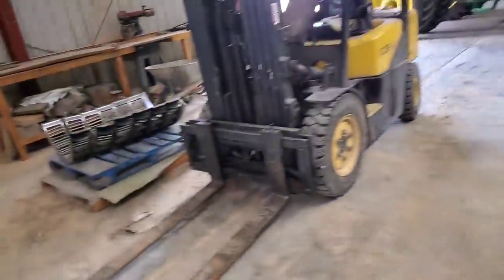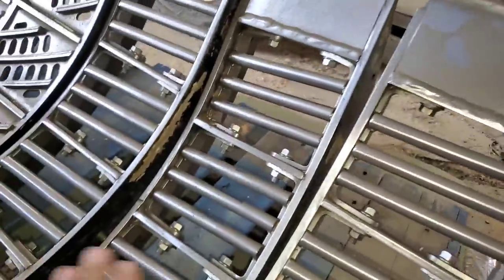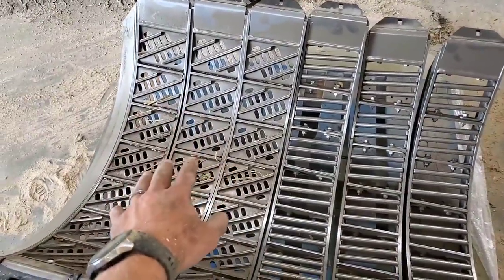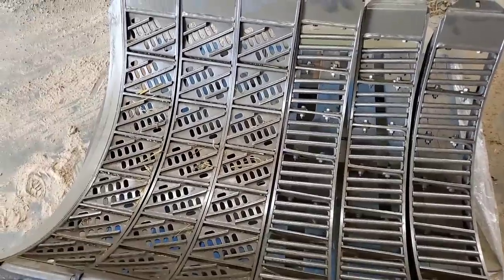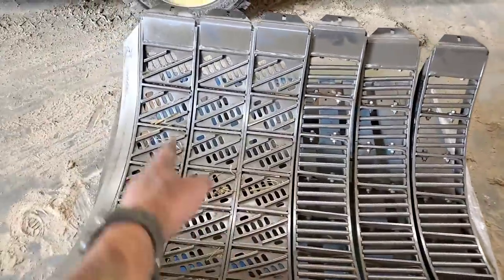A quick preliminary inspection shows we definitely have at least one more bent piece — this one here is for sure bent, and this one here is badly bent. We've got two different styles of concave: the Max Round and the Max Thresh. The Max Thresh style is more aggressive to help thresh the grain, especially in wheat and small grains. For wheat we put the aggressive ones in positions two and three; for beans and corn we leave one aggressive one in the front and five round bar ones.